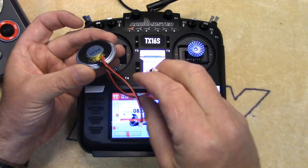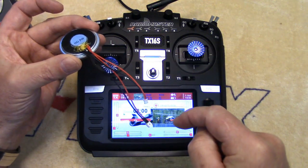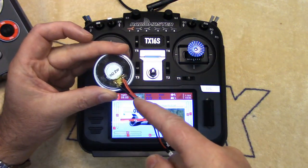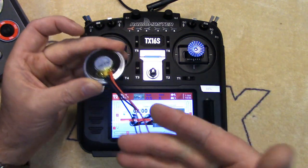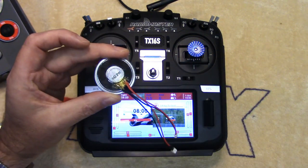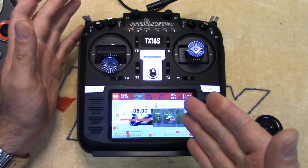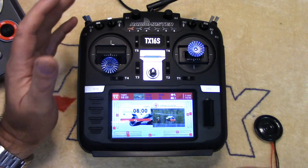There's basically a female Pico plug and a male. The male plugs into the circuit board where that speaker was plugged into, and then that speaker plugs into the female here. So they're wired in parallel. Assuming this one's 8 ohms and this one's 8 ohms, we'd have a 4 ohm impedance system afterward. As you saw in the review I did on that — I'll link to it below in the description if you didn't see it — one of my biggest complaints was the sound volume.